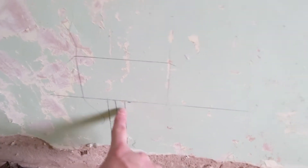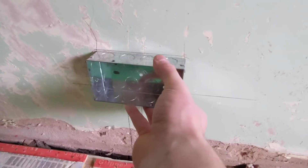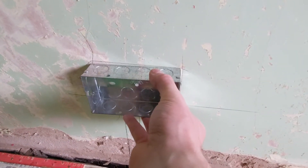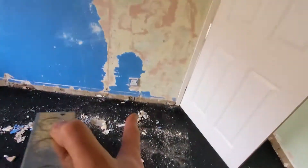So what I've done is I've marked out on the wall here where it's going to go. For those of you wondering why this is off to the side, it's because these circles in the bottom are where the cable goes through and they aren't central, and we're going to re-plaster again afterwards. So that's going to go into the wall there and the cable will run down and go under the floorboard and we're going to add a spur to that one.